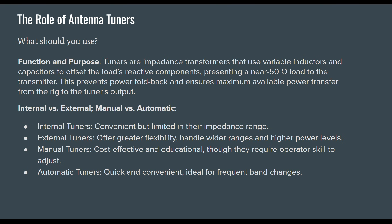As hams, we want to get as much power out of our radio and into our load — the antenna — as efficiently as possible. SWR and lossy coax both work against that. So we go through a balancing act: finding an appropriate SWR, achieving that potentially with a tuner at the antenna feed point or at the shack, combined with reasonably low-loss transmission line — whether ladder line or coaxial cable — to arrive at something acceptable.